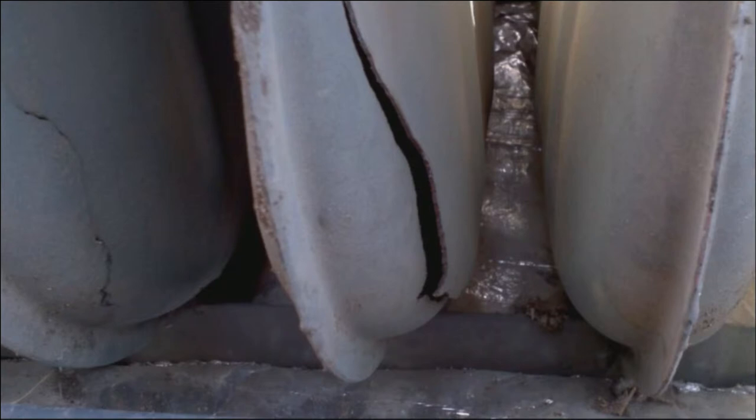You'll see discoloration of the metal, those sorts of things. So a lot of overheating. So if they don't fail, I mean, it's not a big deal. However, they will cool the flame some. But when you start to look at if they break and they start to change the way that the flame is burning inside the heat exchanger, it could cause a safety issue.